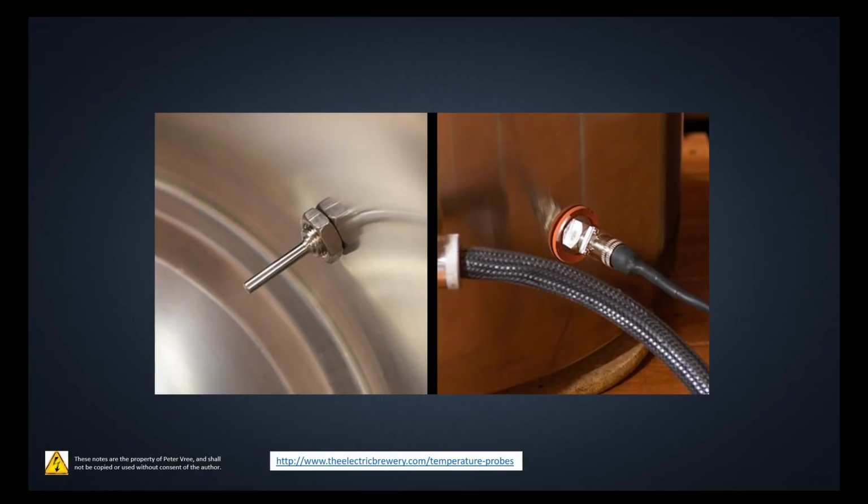Okay, a couple more. This one's on the bottom of a vat. So you can see here that the wiring is on the outside. Then it's got this kind of flange here. And then the RTD is mounted in the bottom of the tank to keep track of the temperature in the tank as well. So you'll see them in piping systems, ducts, and in tanks as well to keep track of your temperature.